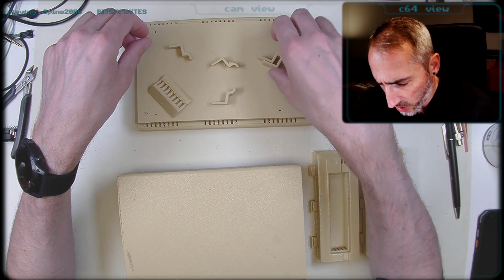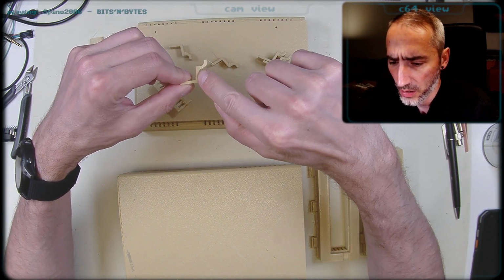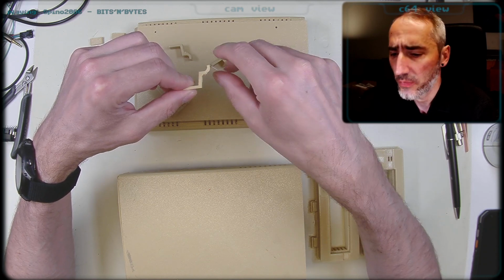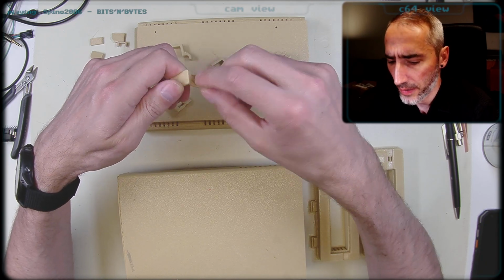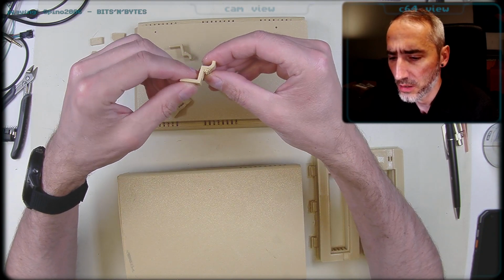And then I started to, let me find the right part, change the model a little bit so that there is some sort of an angled area or something like this to avoid this huge overhang. And this has improved printing quality a bit. Here we can see the difference.